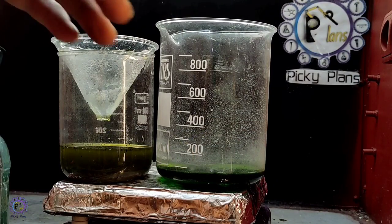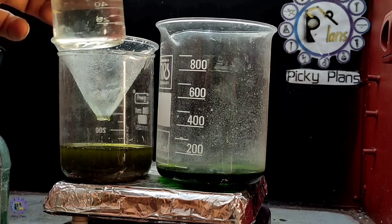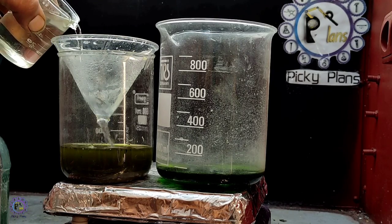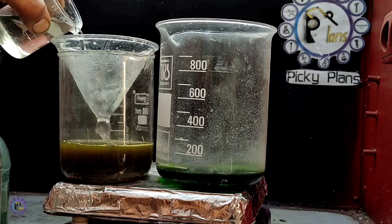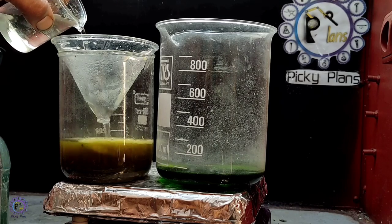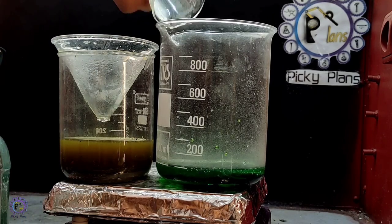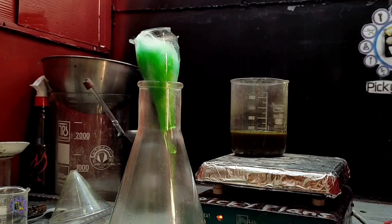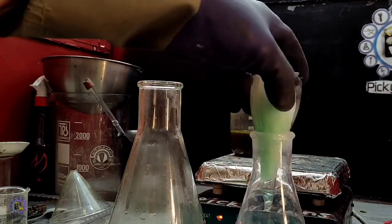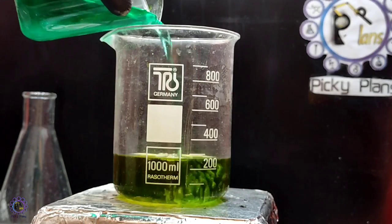I let both solutions — the gold foils and BGA bottom layer — sit for several hours with aqua regia. There might be some gold precipitating back since we had some base metals like copper in the solution. To fix that, I decided to add a very dilute solution of bleach to make sure any colloidal gold or very fine gold particles in the solution would be dissolved. Then I started filtering the solution. Since there isn't too much gold in the BGA bottom layer and also from only eight motherboards' gold pins, I decided to mix these two solutions to make recovery more efficient.